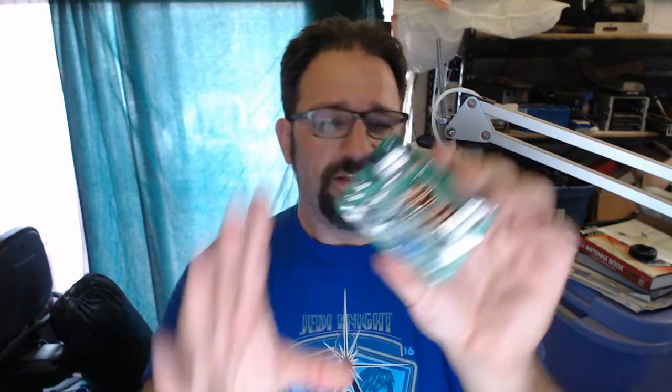And I found this out when I was doing my trip to Kansas. This is, I think, a 10 amp, maybe 20 amp. I don't remember. This one's a nice and beefy one. I mean, look at that heatsink. This is a really nice boost controller. This is a boost module, and it's got a constant voltage and a constant current adjustment on it. And the problem is that if you've got a low voltage input, it will boost that up to your output voltage. The problem is that in conditions where it's high current, where the battery is trying to charge with high current, it is not able to drop the output voltage below the input voltage.